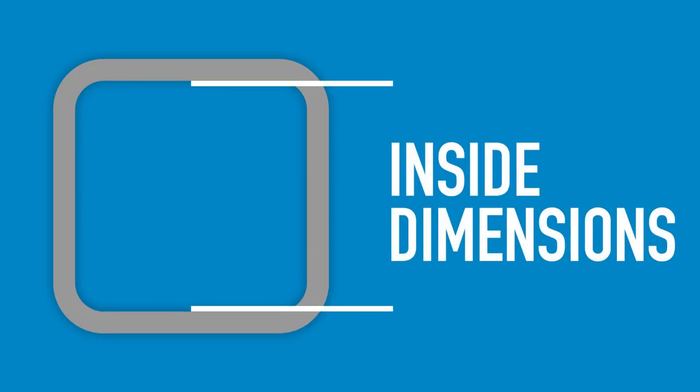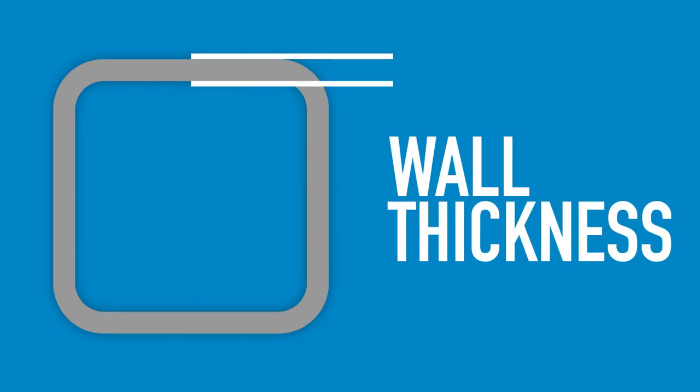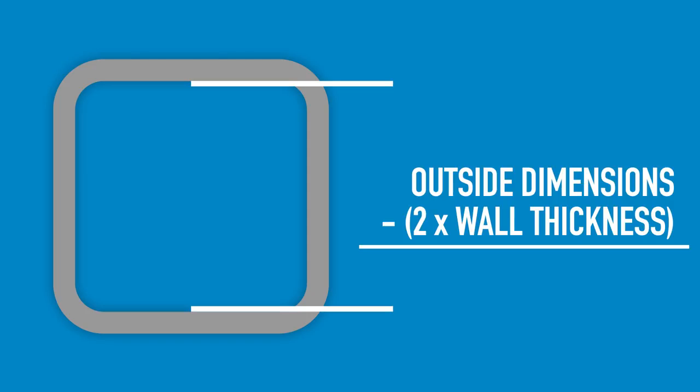Our first tip for telescoping tube is to use square tubing. It is the most commonly used shape for telescoping and works better than round tube or pipe. To make sure your tubes will telescope properly, you need to know the inside diameter of the larger tube. If it's not provided, you can simply measure the ID, or you can measure the outside diameter and the wall thickness, then subtract the wall thicknesses twice from the OD.